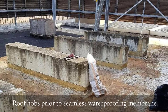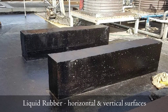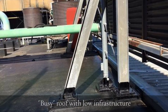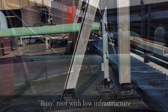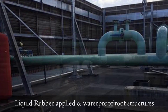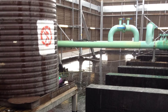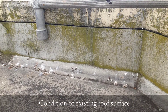There's quite a bit of infrastructure on this roof, so we had to work around it — particularly low infrastructure, which was a big problem for a lot of other types of coatings, or sheet membrane in particular. Because we can isolate those and flood coat underneath the low equipment, we can actually provide a watertight seal under there, whereas other applications can't get under there at all.